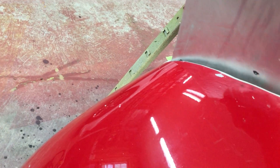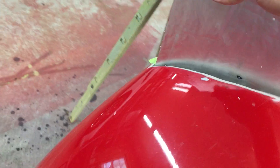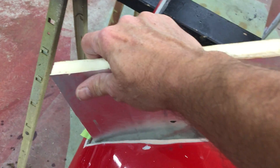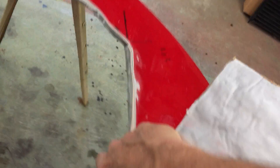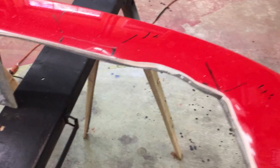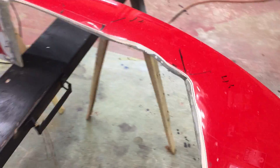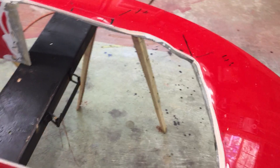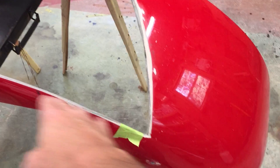This part will go in like that, and you can see the lines actually kind of match up. I'll have probably three blocks — one right about here, one here, and one at the corner — which will stabilize this. When I glue it in, it'll be dimensionally sound and will basically form the entire corner. It will get laid up from the inside. I'm also going to do a second piece that will come from here into this corner and recreate this line all the way to that corner. Once all of this is glued in on both sides, I'll do a fiberglass layout from the inside and let it all cook off. That'll be the beginning of the actual part.